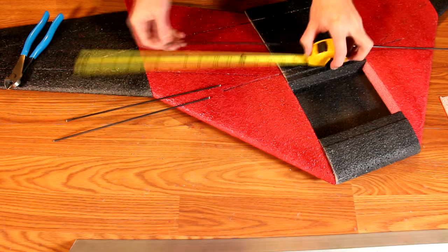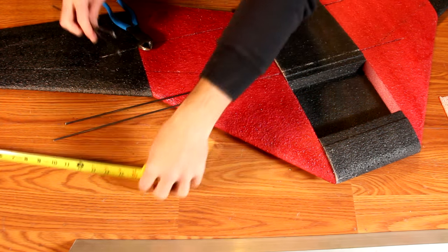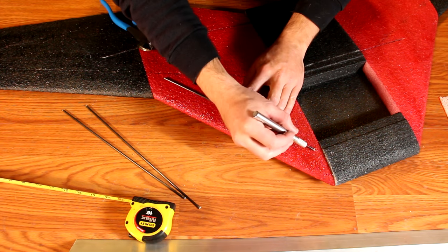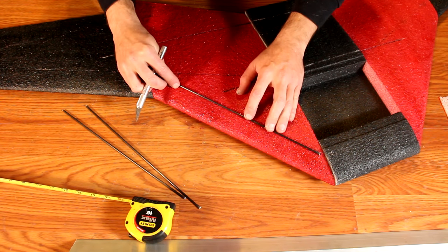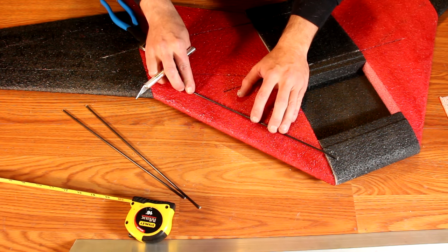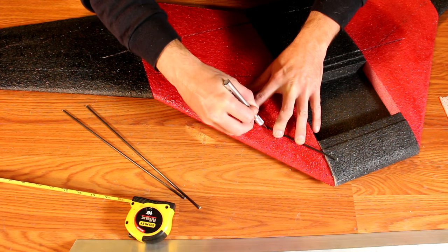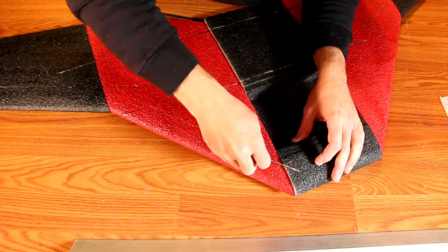Sparring the front is strictly for crash damage prevention. If you wish to do this, cut the spar into four 12-inch sections and embed them into the mid-wing section extending approximately a half inch into the nose. You don't want to go too far into the nose because you have to make room for the skids and the GoPro box. These are installed the same way as all of the other spars — one on top, one on the bottom with a heavy amount of glue. This won't affect the airplane's handling, but it will sure make it a lot tougher if you nose in hard.